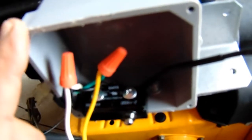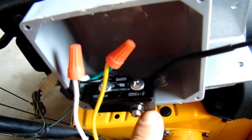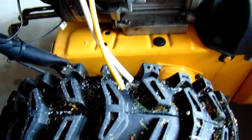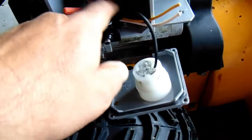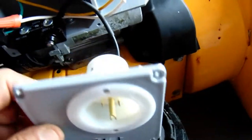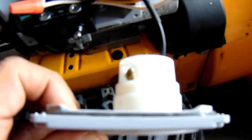Next thing will be to cut a slot for this switch into the junction box cover and to put the outlet in this area right here. I've mounted the switch, I've got my extra wires coming out, and I put one of these receptacles that are $10 at Home Depot. I just need to connect the ground and the white neutral wire, and then we'll see how it looks.